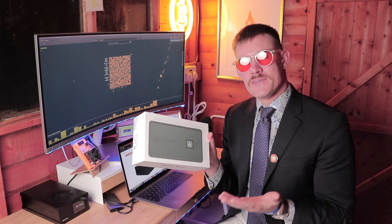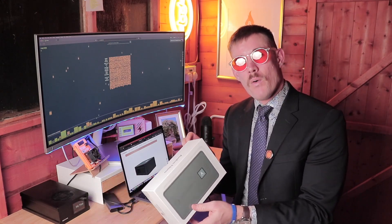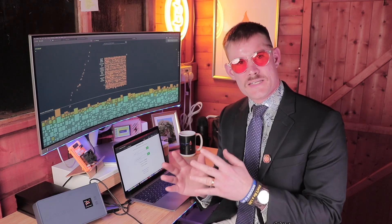Something everybody wants to know is how much a mini miner like the Nano 3 will cost in terms of power. This thing is pulling about 100 watts. There are about 730 hours in a month, so that's about 73 kilowatt-hours consumed if it's on 24/7. If you're paying a high power rate like 25 cents per kilowatt-hour, that works out to about $18 per month.